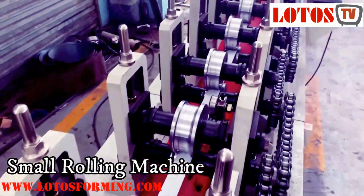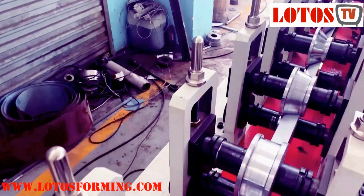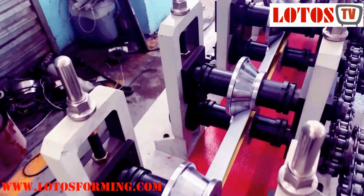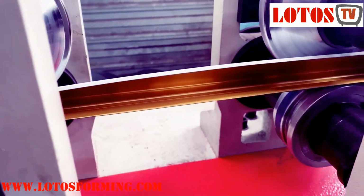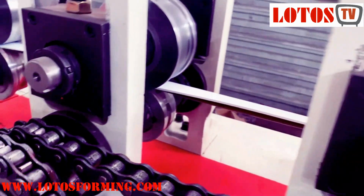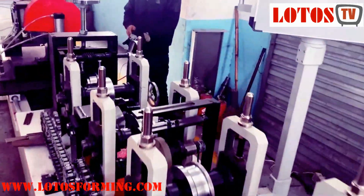In cold roll-forming equipment, suppliers tend to apply chain sprocket transmission for producing thin metal sheets, less than 3 mm, at a normal speed based on the technical needs. Gearbox and worm gear transmission methods are available as per client's requirements, like corrugated sheet roll-forming machine, and stud and track roll-forming machine, etc. Chain sprocket transmission is a cost-effective transmission method. Besides, the chain sprocket transmission method is not suitable for high precision or accuracy applications because it doesn't play well on controlling the tolerance of cutting length.